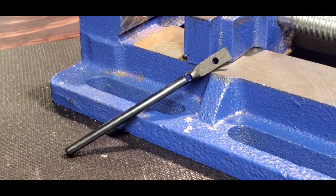a plunger head assembly on my micrometer measures in at 0.91. After it's installed into the MeanStreak or the Ol Blue Hare, it increases it to 0.92. That'll get you just a sliver more seal compression within your chamber.